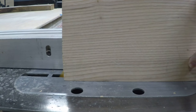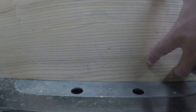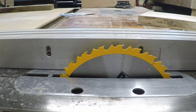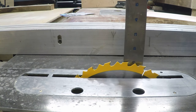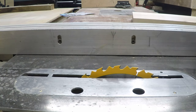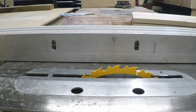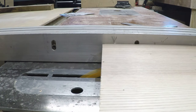During this cut, be sure to be placing pressure against the fence. The most important part of this cut is going to be the squareness to the blade. Now we're going to set up for our next cut. We'll lower the blade so that it is max height 7/8 inches tall, and we'll set the fence so that inclusive of the blade width, the cut is 2-3/8 inches wide. Then we'll be ready to make our second cut, which will finish the notch.